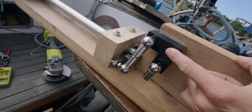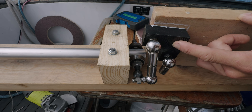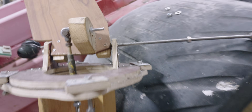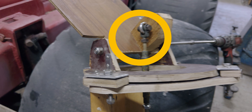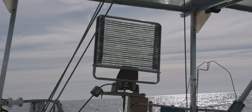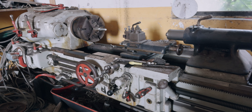At first I had a 3D printed L-part in the design — it probably would have worked for several months. But because I was with Bertil and he had some metal parts laying around, he welded a better L. The bearing is probably unnecessary there as well, but it looks cool. The power of the wind probably overrules the little friction of metal to metal. Then there is the M10 rod up to the wind paddle. This kind of wind paddle design I have seen on many trim tab self-steering systems, but not on this kind. I made two different connections to the wind paddle to adjust it. We used a turnbuckle to adjust the length of the rod to make the paddle stand up. The rest of the rod is the pivoting arm for the paddle. We bent it down and Bertil made a counterweight from some stainless parts he had laying around. What a dream it is to have a farmer as a friend — you really need a farmer friend.